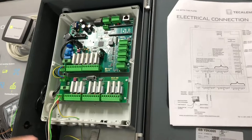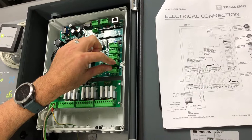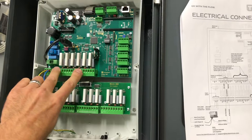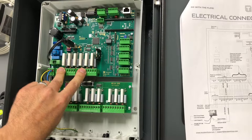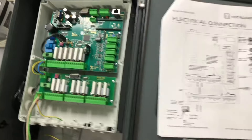If you've got a two-hose super box, you're going to have two modules: your contactor relay outputs or pump outputs, along with A and B slots which are your pulse meters. For a five-hose super box, you'll consequently have five pump outputs and five pulse meter slots, A through E.